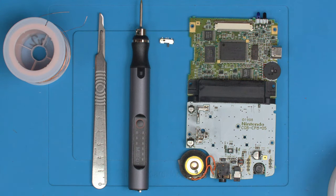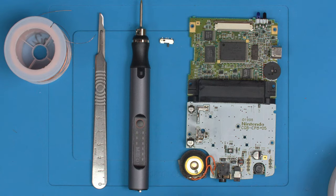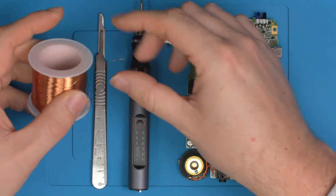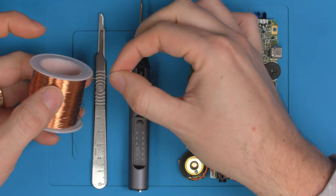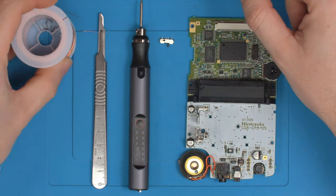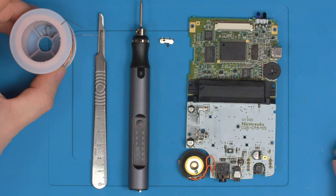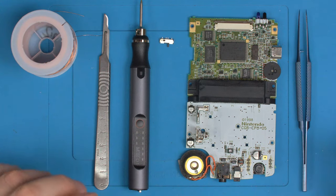You don't really want to be using thicker wire like Kynar wire, because when you move those wires you can tear traces on boards. Enamel wire is so thin and flexible that it will never tear the trace on the board. It's coated in varnish, so even though it looks like bare copper, it's not conductive — it has a varnish insulating it. We have to scrape away that varnish. Finally, a set of tweezers — that's all we really need to begin the repair.